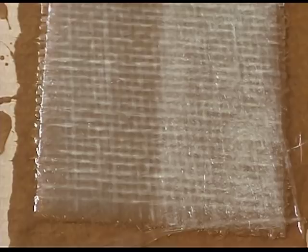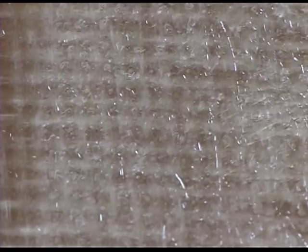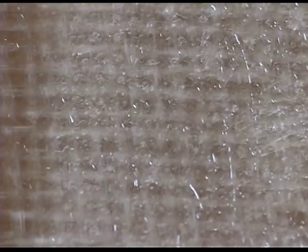Okay, it's been about 4 minutes since we laminated that last piece here. I've come in real close with the camera here to try and show you the difference in laminate texture. This is the aired side, or the de-aired side, using an aluminum roller. And then I'm going to move over here to this side, and you can see the actual air that's trapped in this laminate. It's quite significant. This would actually lower your strength, allow water or other impurities to work their way into the laminate over time. This is a good example of rolling and non-rolling a laminate using an aluminum roller.